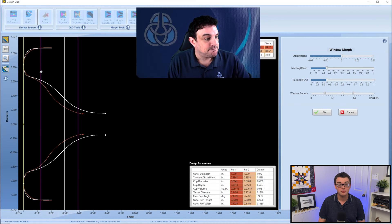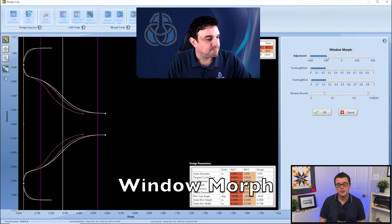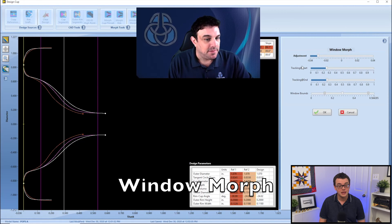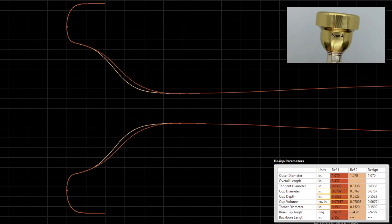Then I wanted to make a design for orchestral pops. The toughest thing about finding a good orchestral pops mouthpiece is that I have a lot of what's called lip engagement — basically, my lips go into the cup a lot when I play, and my lips tend to touch the side or bottom of shallow mouthpieces, which stops the buzz entirely. In order to make a shallower mouthpiece that I could actually play, we needed to reduce the volume of the cup without changing the section just below the rim. To do this, we used a design tool called Window Morph, which allowed us to choose exactly which section of the cup to alter — the top portion could stay the same to work for my level of lip engagement, while the bottom portion could be made shallower for pops playing. We ended up with two prototype pops designs: Pops A and the even shallower Pops B. I was determined to try these designs in 24 throat, since that's what I'm used to.